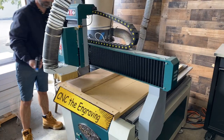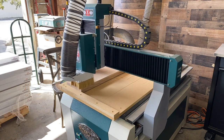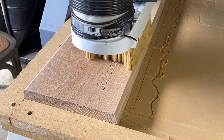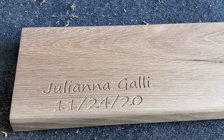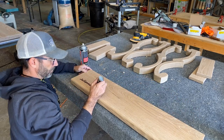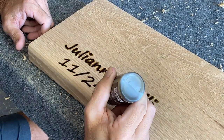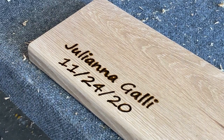The middle shelf — I'm going to use my CNC router to do a special engraving. I wanted to engrave my daughter's name and her birth date into it. Using dark brown tinted CA glue, I filled in the routed edges of the engraving and then took some fast-spraying adhesive and sprayed it down. I let it sit for an additional 20 minutes before I sanded it smooth. Came out really nice.